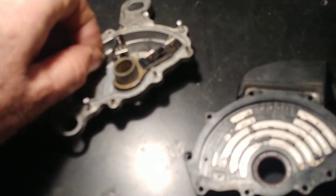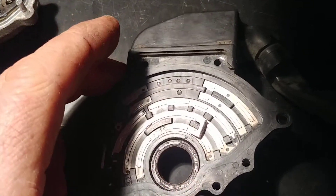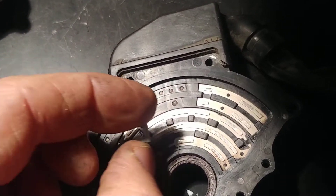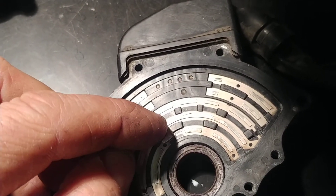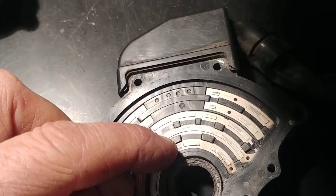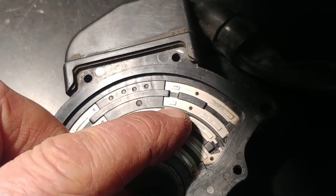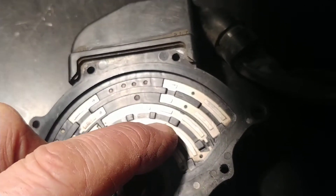You can see here - let's get one of these conducting bars out to see how far it spans. It spans across, and when you don't want it to touch across there - evidently to create the digital connections - they have a ridge of plastic to hold it up and out of the way. I did find pit marks into the metal, like when you have burnt-out switch contacts, somewhere in there under the microscope.